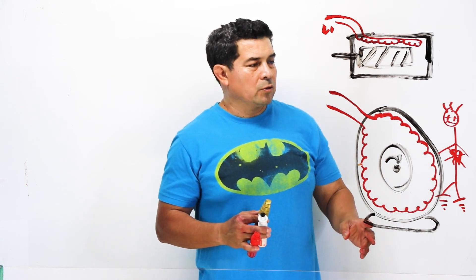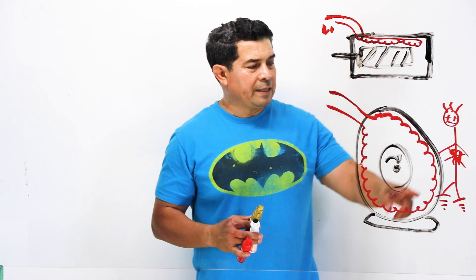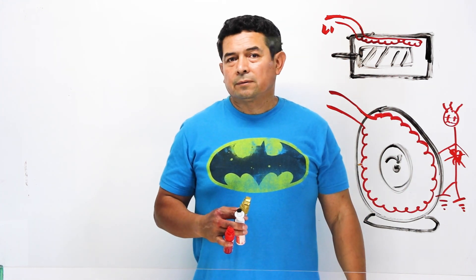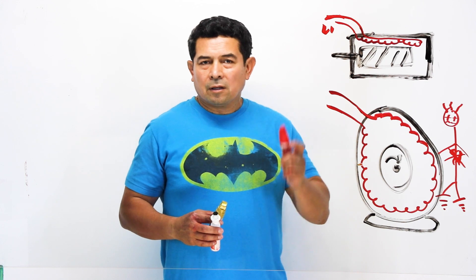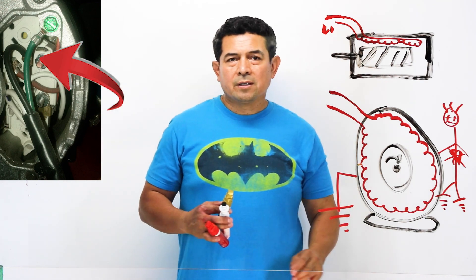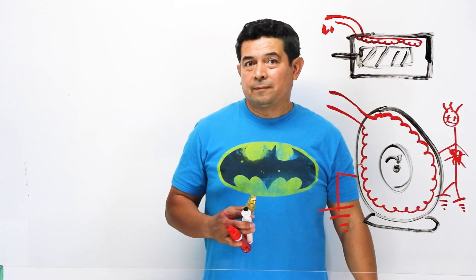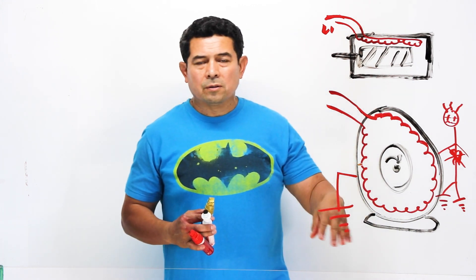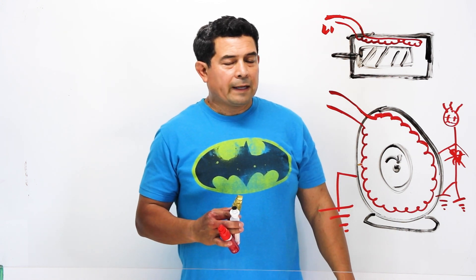Now I know we see it in movies where people are frying and there's smoke coming out, but it doesn't have to be like that. All that has to happen is the electrical signal going to your heart has to be disrupted. Once that's disrupted, your heart doesn't know what to do and it stops. So what is the most important wire you could possibly have? The most important wire is your ground wire, because this ground wire is not going to have any resistance. Because it has no resistance, electricity is going to go through the ground wire rather than through you. Usually this is a green wire that goes to ground — to some metal mounting, or like I said, the cold water pipes.